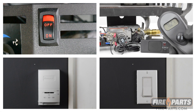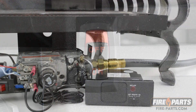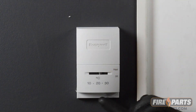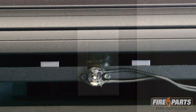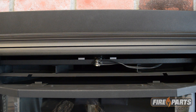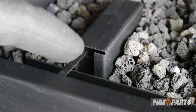There are different types of switches for millivolt gas fireplaces. A fireplace may have one switch or a combination of switches. Some switches are a unit switch or toggle switch, a remote control, a wall thermostat, or a wall switch. Keep in mind that the switch circuit will sometimes have other safety switches in the circuit, such as a temperature limit switch or a door switch.